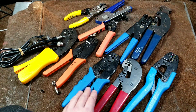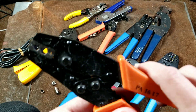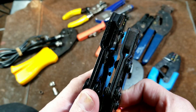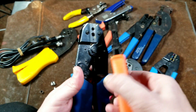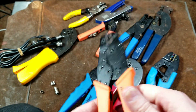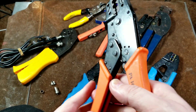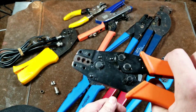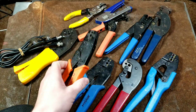There are also different design styles. These Jensen crimpers, and then these — which are a real compact version of the Jensens — essentially have the same amount of leverage because the jaws are so much closer in, nearly a half inch closer. They use compact dies to get a lot more leverage, affording slightly shorter handles so you can have a more compact tool with the very same force. This actually ends up weighing about a third less than the Jensens and is really nice.